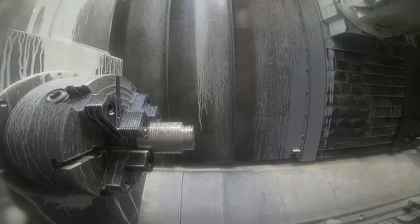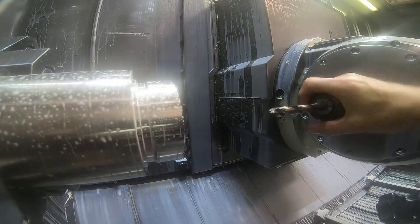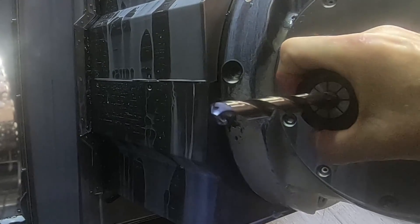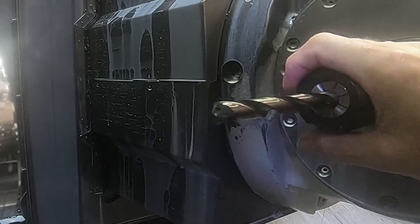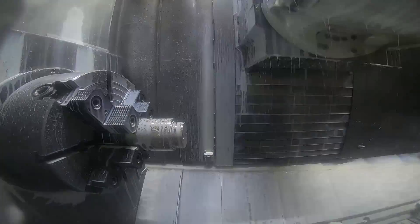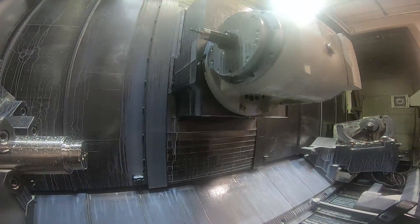I'm going to come back later and finish that hole at the end of the program. This is a 495 drill in preparation for the half inch form tool that's going to go in that hole. It's kind of a form reamer that I ground on my grinder. You may have saw a photo of those drills — I reground them on Instagram that I posted.